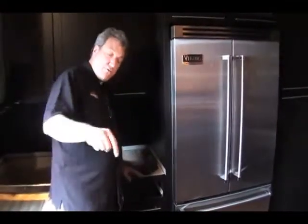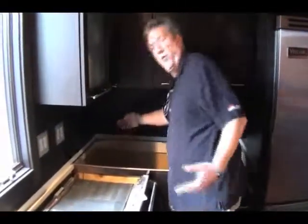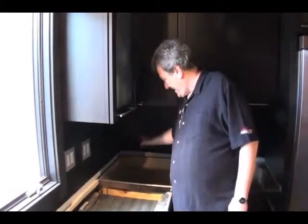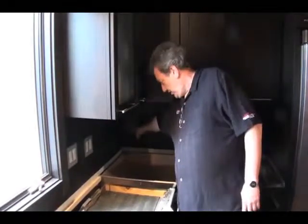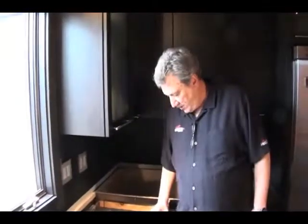Now I'm going to switch over, start a new line, and hit points every stud roughly along here. You can hit more points. Notice I stop about three inches out of the corner to allow for the drywall mud buildup. Put one in the corner, three inches out of the corner, and as often as you'd like all the way down to the scribe wall. Generally you need one about every 16 inches, or less if you want to be real picky.